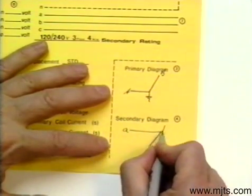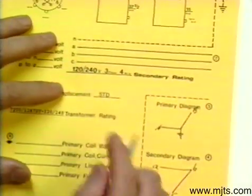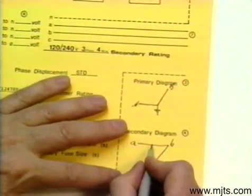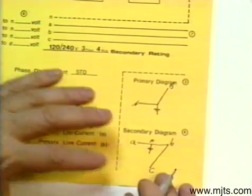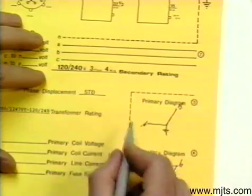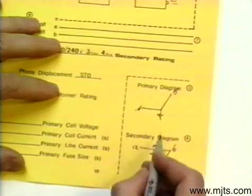A would be here, B there, and C there. We know that we want four wire and 120 volt. To do that, we'll center tap our larger transformer — that will be our lowercase n — so we'll end up with four wire. It doesn't make any difference which way we go with polarity as long as the high and low sides correspond.